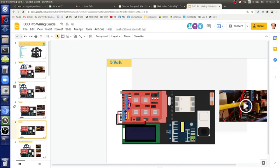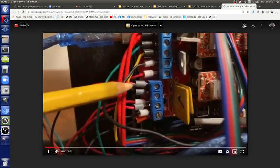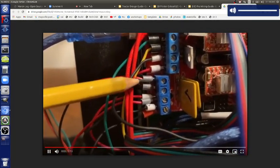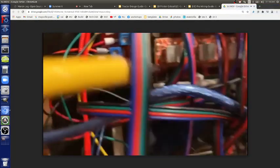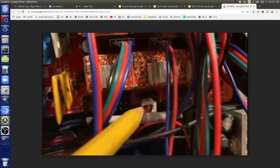So I finished mine last night by 11:30. It's all wired up, ready to be connected and tested. Here are those headers, and there's a double white pin, and you can probably see it in the video. The 5 volts is these upper ones here. We have positive on top, negative on the bottom, so red, black, that's going right here. And there's that double white plug. Polarity matters.